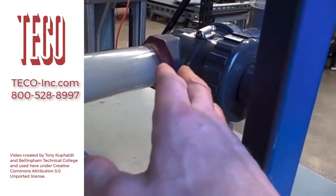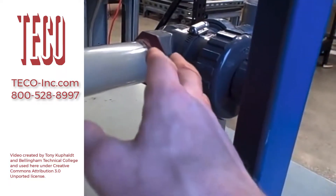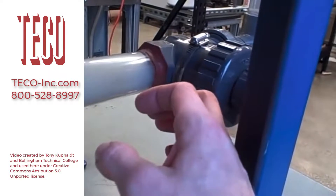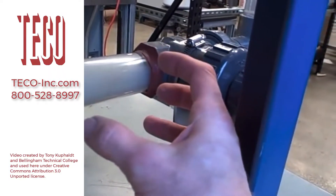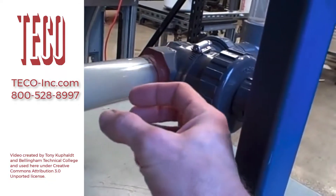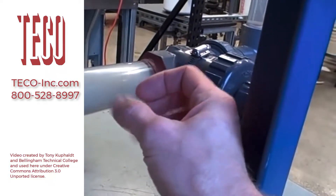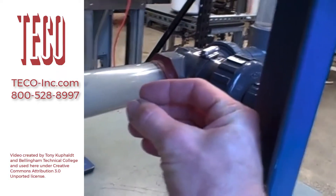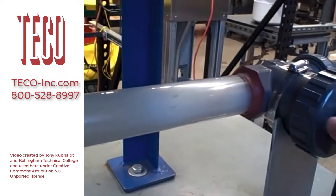As the water goes through the valve, it reduces pressure going to the restricted area. Its pressure drops below the vapor point of the water at that temperature — it flashes into steam. And then after it comes out of the valve and expands again, the pressure goes up. What happens is those vapor bubbles collapse back into liquid, and that's when we get the cavitation effect.